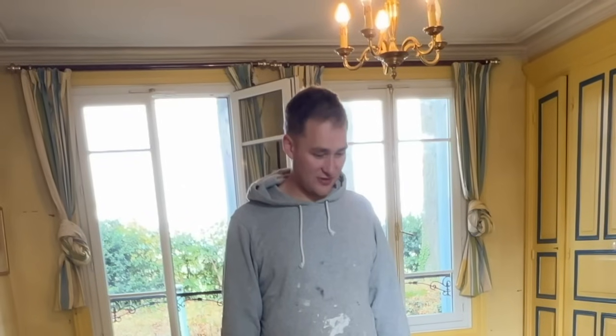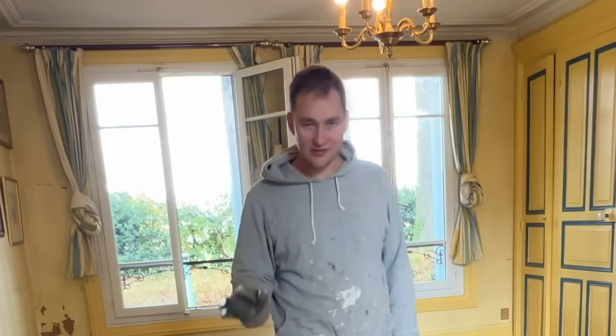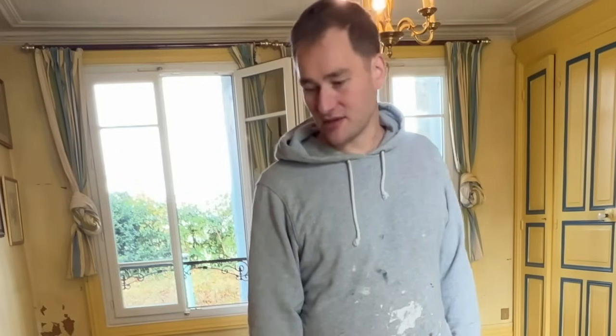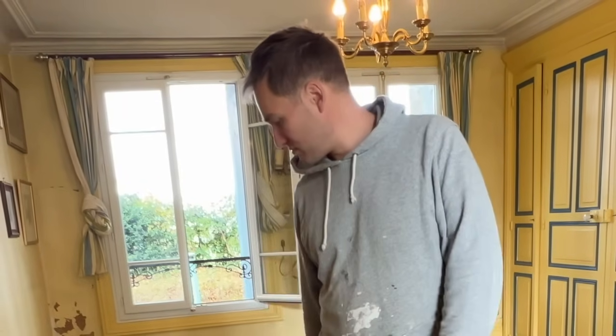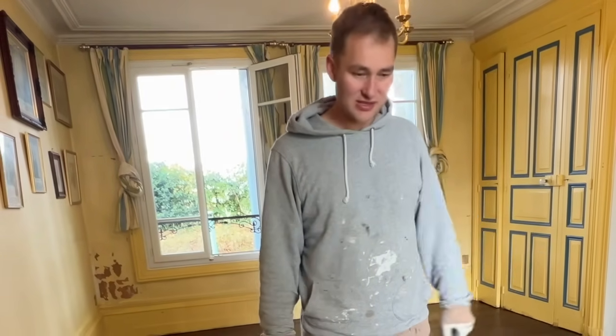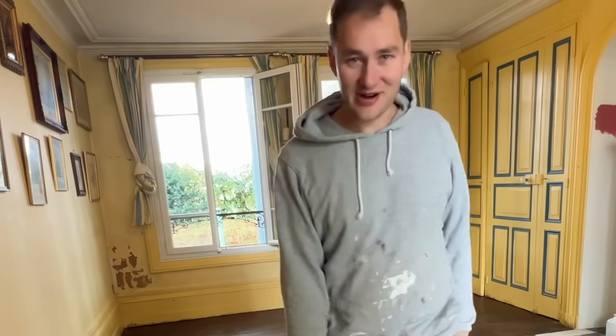I have sanded down the floor, given it a light little sanding. Now it's putting on the second coat. I've just added a little tint of the stain this time because we've already got those on the floor. But I figured it would be good to just have a little bit of the stain for some of the areas which are a little bit lighter, or where we've sort of sanded it back to the wood if they were raised. So yeah, let's crack on.